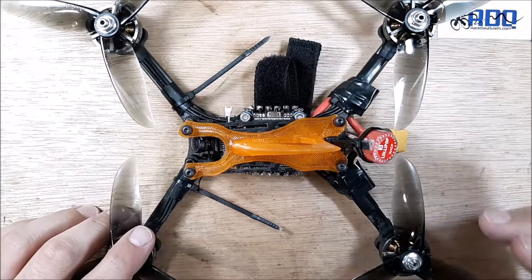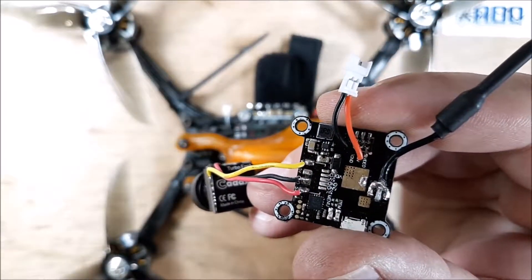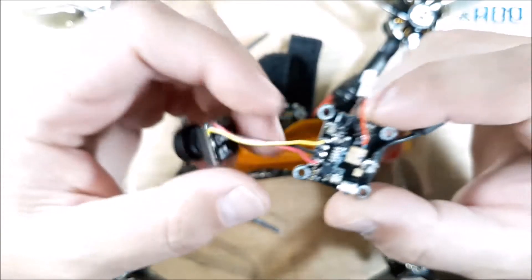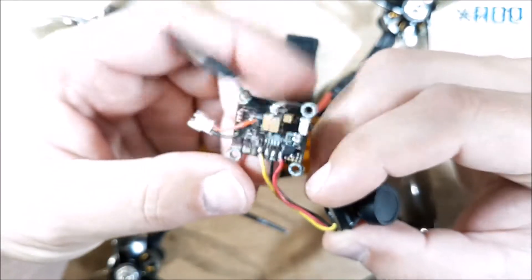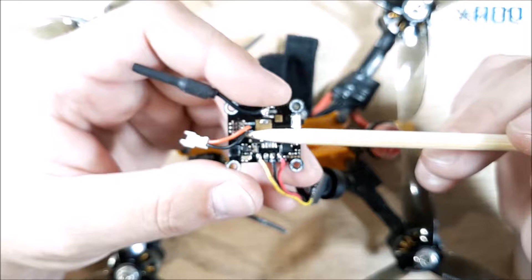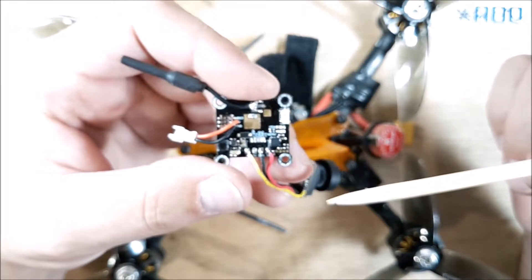You're basically seeing someone else's OSD — not good when you're ripping around the track. So I'm going to go ahead and replace this VTX, but I wanted to go through some general rules about pretty much all VTXs. So you have your camera going to your VTX, and all VTXs are going to have power coming in — either five volt or battery voltage — and a ground. The only other wiring you may have is smart audio. So you're going to have power, ground, smart audio, and then camera power out.